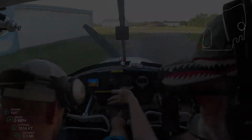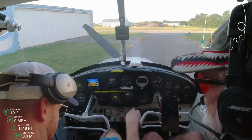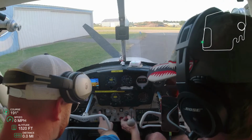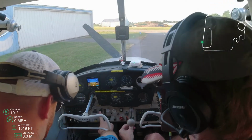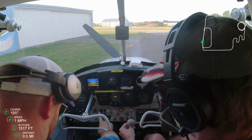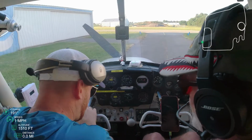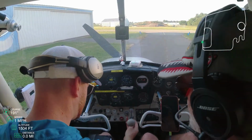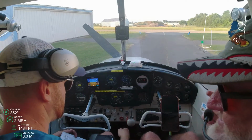Next here is carburetor heat. Next to the throttle is the carburetor heat. And the primer down here, if you want to prime it, that usually helps it start right off whenever you give it a shot of primer. So you pull it out and you let it fill up with gas. You can feel the pressure whenever you're pushing on it, the fuel in there. Sometimes in the wintertime, I'll leave it out, and then I'll give it that shot when I'm starting it, and it starts right up.